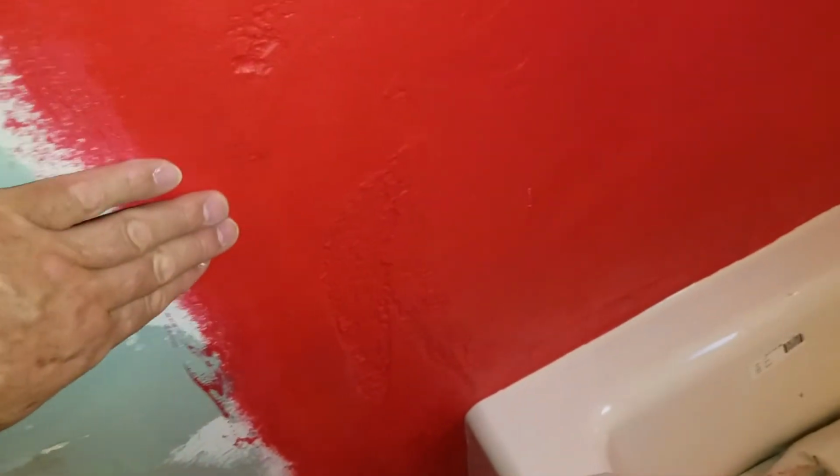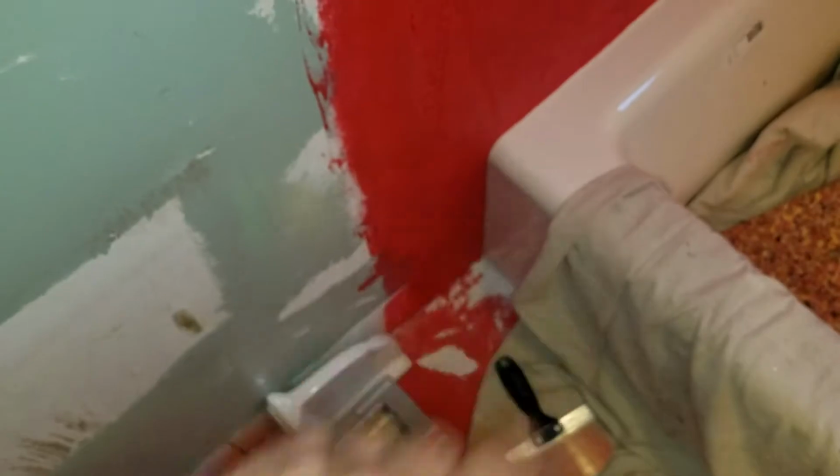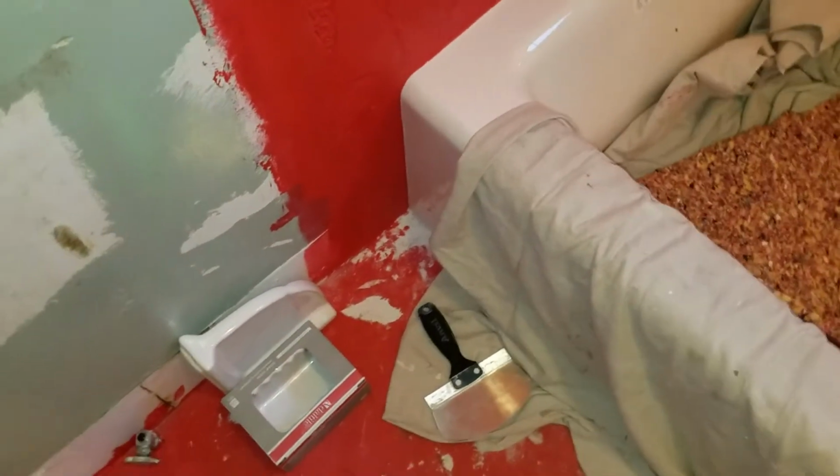And so you see here is the border between the sheetrock green board and the Duroc here. And so I'm going to have the bullnose tile end out here somewhere, and the last subway tile will span that, so that it will be a full tile crossing between the two different types of wall material. And so that should work out pretty nicely. And then once again, I will space the bottom up so that the marble will just fit right under it. So things are coming along really nicely.